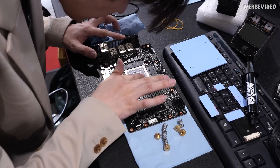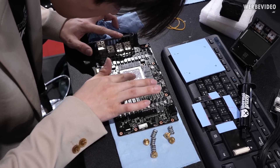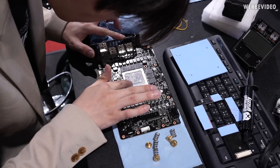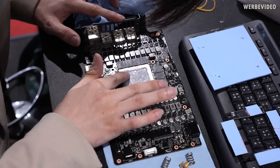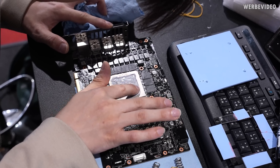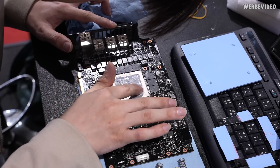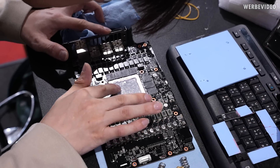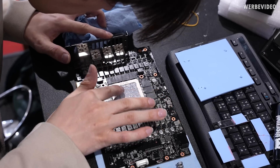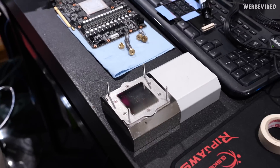Right now the card is getting a new treatment of thermal paste. You might be familiar with thermal paste cracking, where the paste comes loose from the silicon surface — that's why the thermal paste preparation is crucial. We're using a special batch of Kryonaut that works very well at low temperatures. Sunho is giving the card a final touch, applying a lot of thermal paste, because missing even the edges can cause cracking problems or condensation issues on the SMDs.